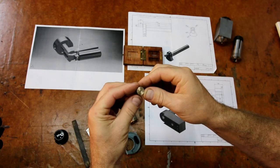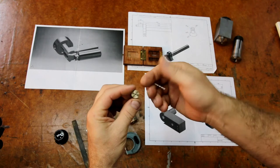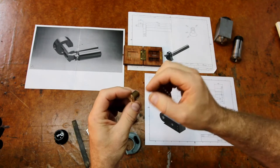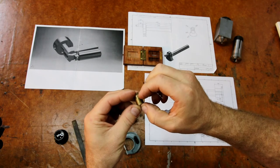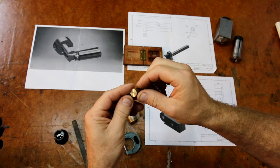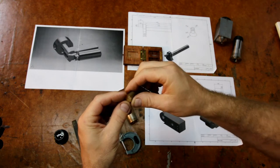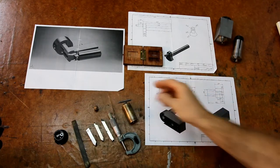So that's my approach. I could grind a three-pointed reamer or similar, but hey, this is going to work for what I'm doing. The bearing surface is 8 millimeters long, so on a 1.5 millimeter diameter, you'd have to get a reasonable amount of wear before the engine will fail or stop running. So anyway, I'll take you through it.